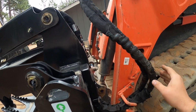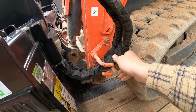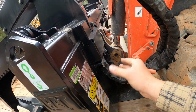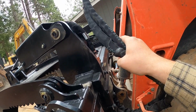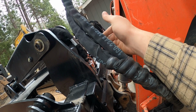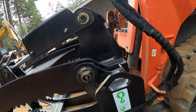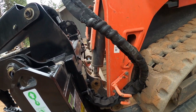When I put the hydro lines over here, at least Kubota had this little holder down there, thingamajigger, so I'm able to use that. And where Cat's lines come out, it's nice. You don't use a bunch of line when you're rotating. On my other grapple, the lines came out of the center-ish, or off the top here, so every time you would curl or tilt down or anything, your lines would have so much stretch to them. So this way, short lines, nice and enclosed and together.